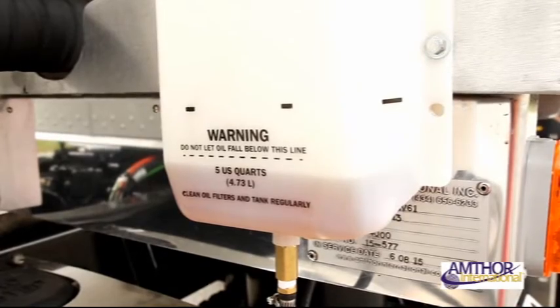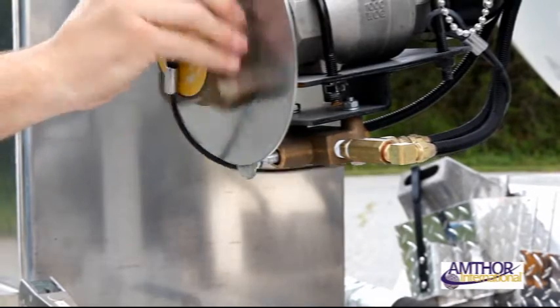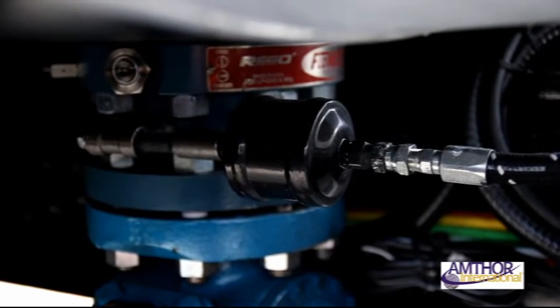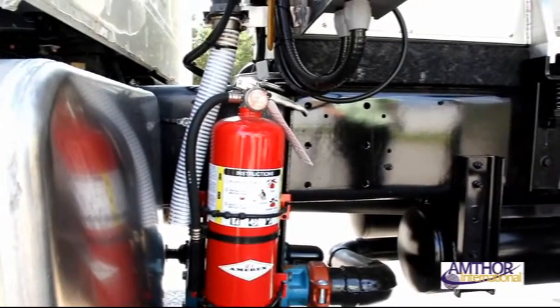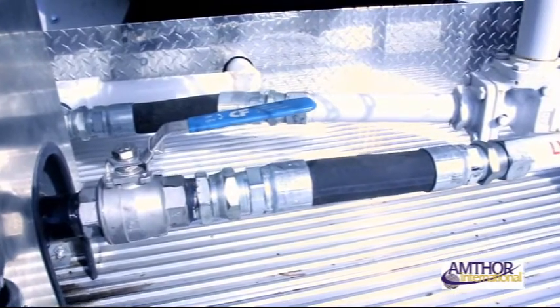Be sure all fluid levels are maintained and filled as needed. If the brake interlock is engaged, remember to properly secure your fill valve covers. If the belly valve does not open, replace the black propane filter under the tank body on the pump system. Ensure your fire extinguisher is certified yearly. Replace hose line every five to seven years or if any detrimental wear occurs.